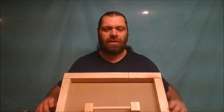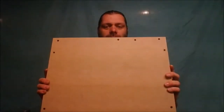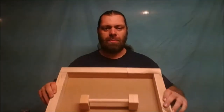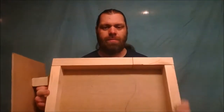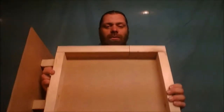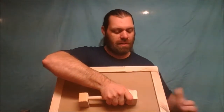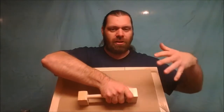In order to melt this plastic down, I'm going to need a mold, and that's what I've got right here. I built this yesterday — it's just a piece of MDF on the bottom, two-by-fours on the top, open in the middle, and this piece lifts out. I put my plastic in there once it's melted, take this top piece and put it back down on top like this, then take clamps and put them on the four corners — maybe the middle too — and start clamping it down.